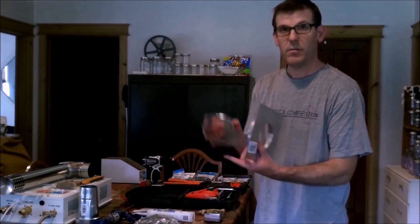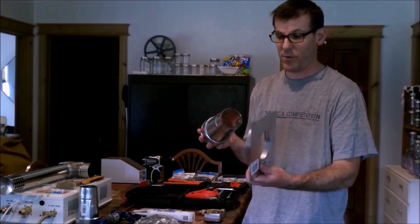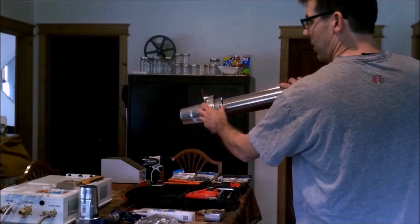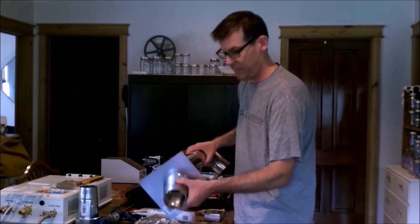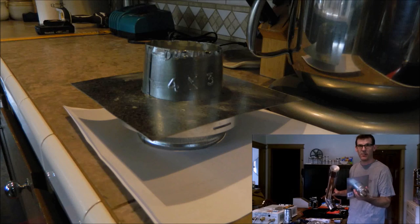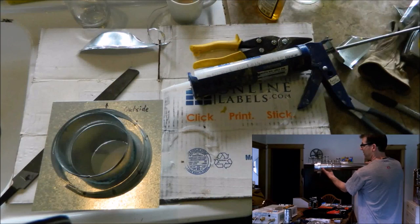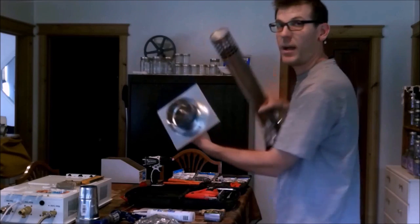I got this universal downsizing cone from the gas vent section at your hardware store. I'm going to punch it through like that, and the vent pipe is going to go right through it. On both sides of the wall I'll measure the distance — as I push it through you can see it doesn't come all the way through — so I'm going to cut the end so it'll slide out perfectly, then silicone that joint for a nice snug fit. I'll do the exact same thing on the inside wall.